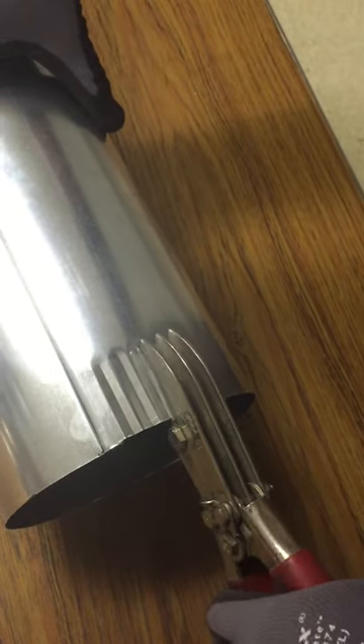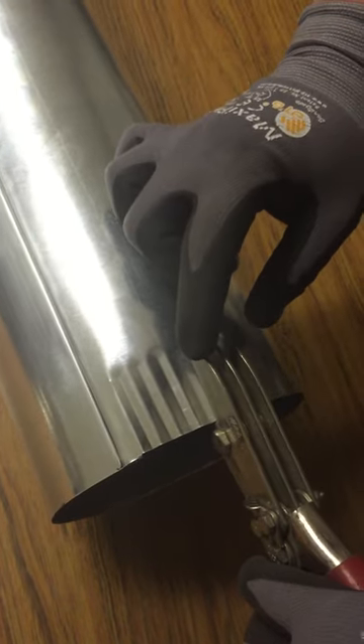Always get two on the inside. You don't need to crimp where the seam is. When you're crimping, it's really nice to make sure you get a good even crimp all the way through. Your last tooth on your crimper goes on your last seam on your crimp, to ensure you get a nice even crimp all the way through.